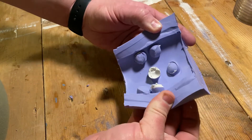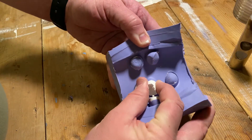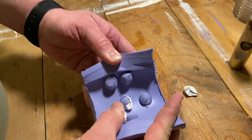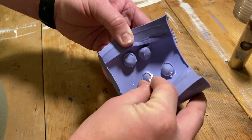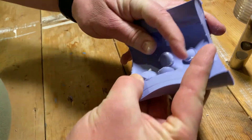As you can see, the inside of the mold has the fingers that we had hoped for — not all the way through, but enough that you can tell exactly where they should be, which I think is pretty fantastic. I'm pretty happy with how that turned out. I wish I could have had the holes go all the way through, but I don't know how I'd accomplish that without severely compromising the mold. What I'll be able to do is after I cast it into acrylic, the fingers going into those holes will be enough that I can fit an appropriate drill bit and drill the rest of the way through.